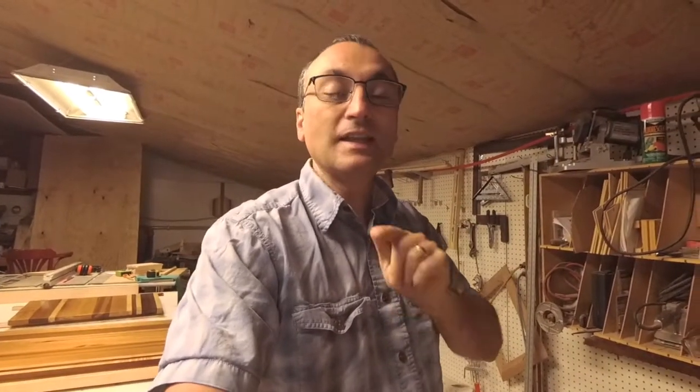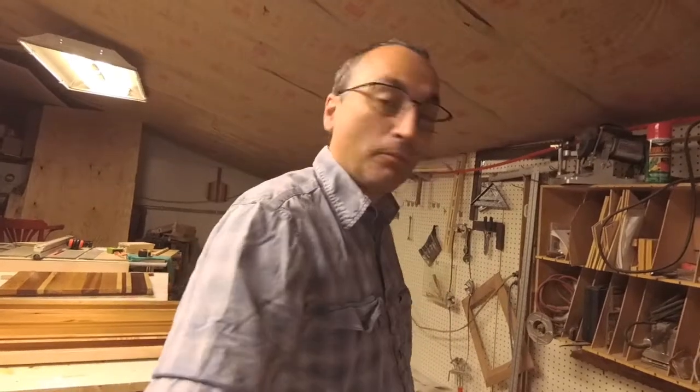We're going to be doing that next summer on a hot day when the floor has already been in the bus sitting. So it's hot too and it's at its maximum size, so to speak. Hopefully it expands. Put it in, leave the gap in hopes that there'll be no other hotter days to make it worse and it can never get longer than the space it's already in and cause any buckling. Because once it starts to buckle, it'll start to break apart, chip at the seams, and stuff like that. And I don't want that.